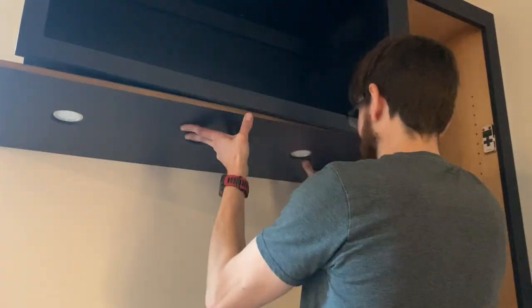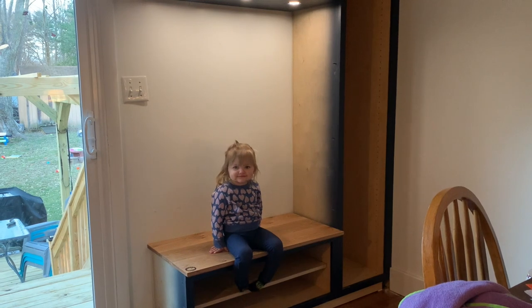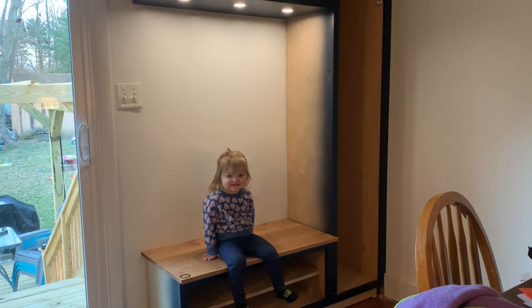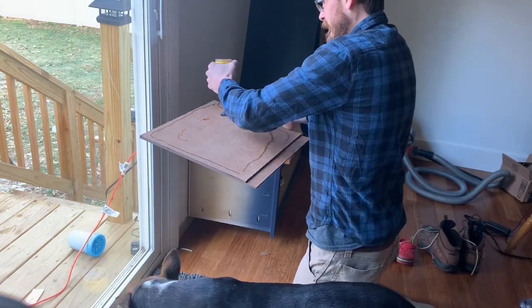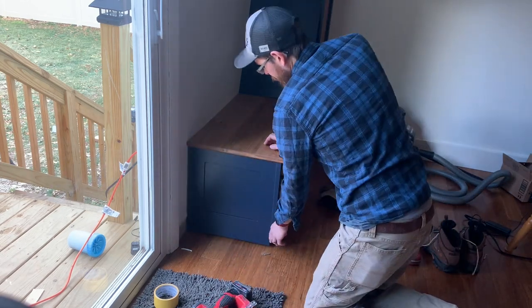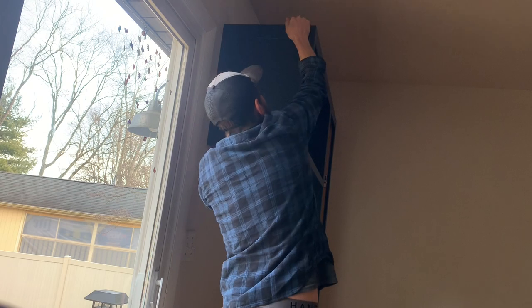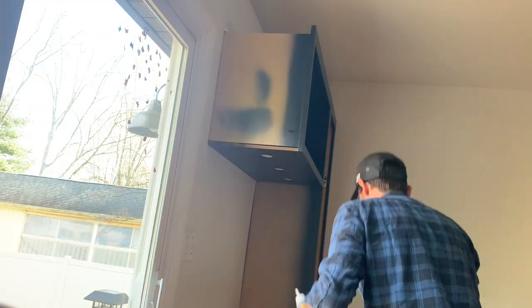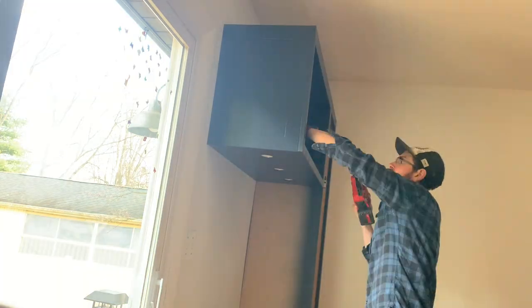With the cabinets in place, we can start putting the panels in. First we start with the recessed lighting panel, which has the three puck lights recessed into it. The wiring goes through the side of the cabinet down to the outlet in the back, and with the lights on — there's my little Joey girl, my little princess, the middle child. She loves it and enjoys the cabinet. With the lighting panel in place, we put the side panels on to cover up those pocket screws and finish up the fit to the floor and to the wall. Those are the glued pieces of hardboard — HDF — and it looks like a raised panel, like one of the doors on the side of the cabinet.